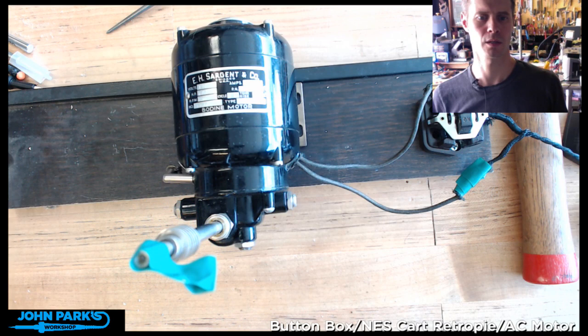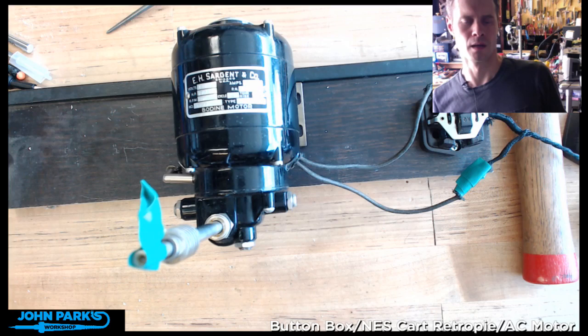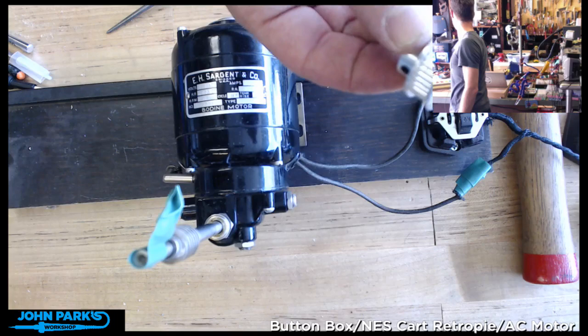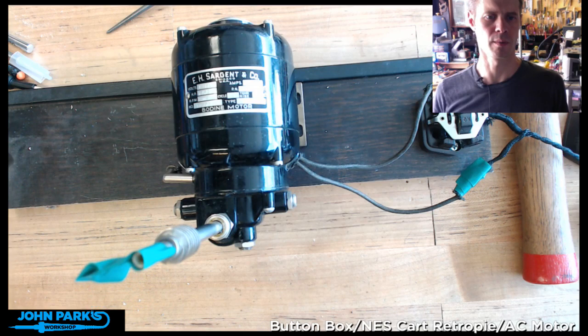Oh yeah, speed control. TrueTech, I would love to do speed control. This one's non-reversing, so I don't think you could go back and forth with it, which was one of my ideas at first, is to use it to drive. I bored out a little timer pulley yesterday, so that it would fit on the end of that shaft. And I have some timing belt I can turn stuff with, which is kind of cool. But if you're not with a DC motor and a motor controller, it's a little tricky to be able to move stuff, because you can only go one way.